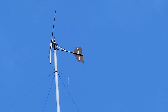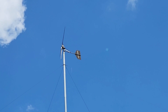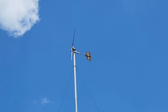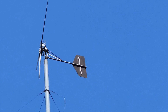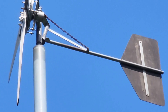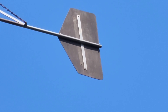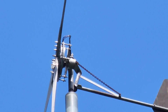I won't get into details about the alternator itself — there's more on my channel about that and there will be more to come. It furls to the side. I wish it was windy so we could see it running, but it's not. You can see the tail pivot, and the tail is held in place with a chain and it can swing up in a high wind. Blades will furl to the side.